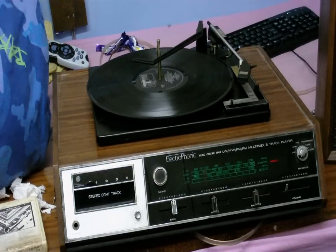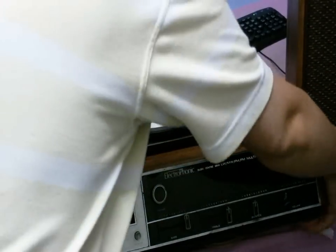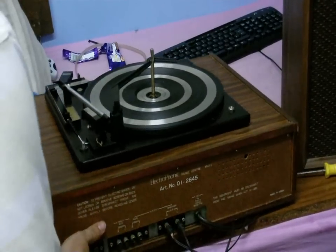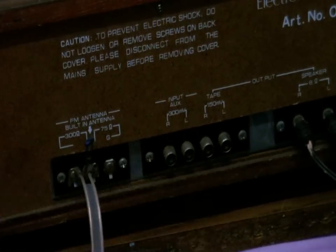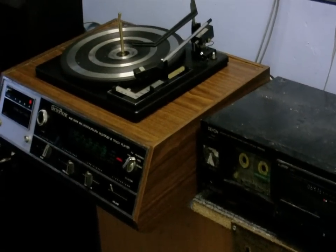That's really, really good. Now I just need to give this thing a little bit of a clean and it'll be ready for the shelf. I've cleaned it up and put it back together and now it looks really good. I'll just show you the connections on the back: we have antenna connections, provisions for an auxiliary input and output to tape, and speaker connections. I found out when this is from — on the bottom there's a schematic diagram and right here it says "Jay Parker 1975 716", so this was made on the 16th of July 1975.